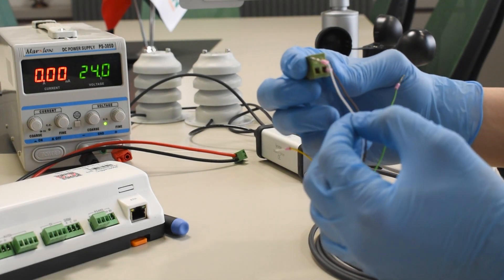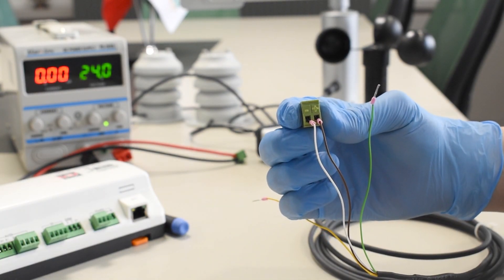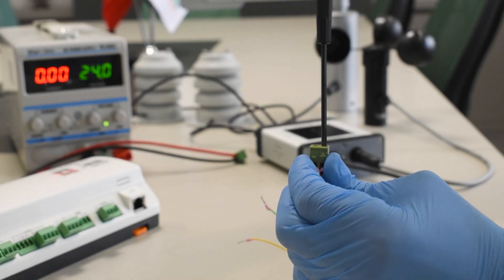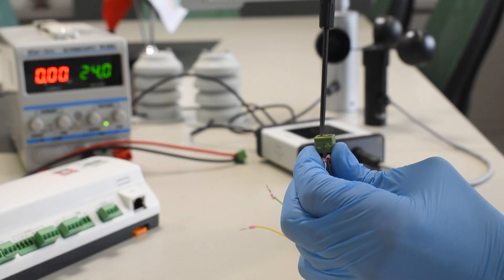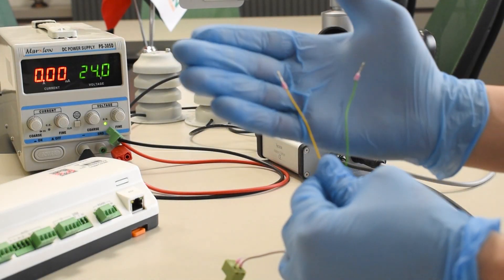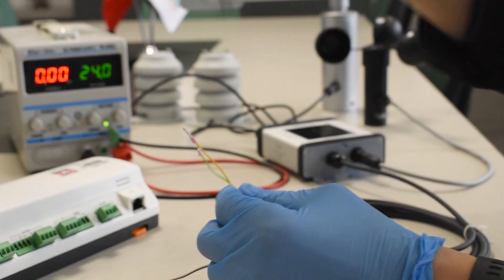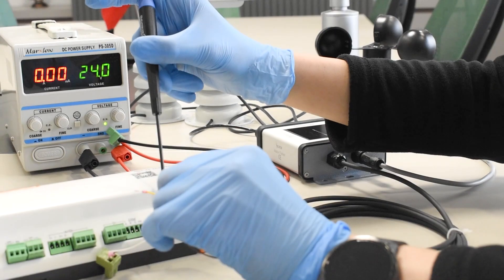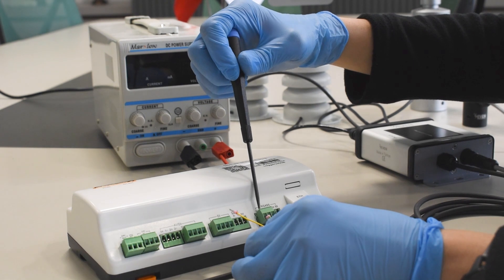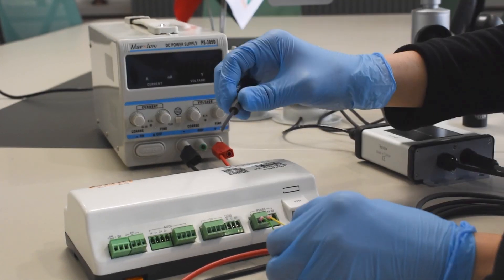The brown wire connects to the power supply plus. The white wire connects to the power supply minus. Seven sensors operate with a voltage of 12 to 30 VDC. The recommended voltage is 24 VDC. The green and yellow wires connect to one of the COM ports on the Sangro data logger. The Sangro data logger has three Modbus COM communication ports. Once you have chosen which port to connect to, connect the green wire to the input marked as data plus and the yellow wire to the input marked as data minus.